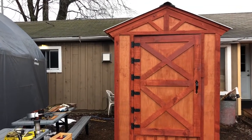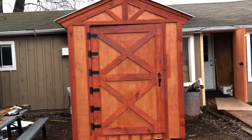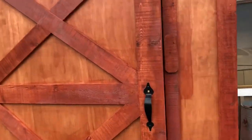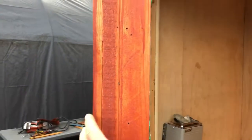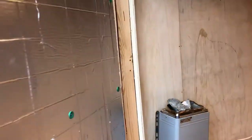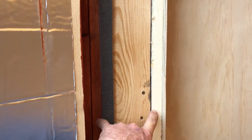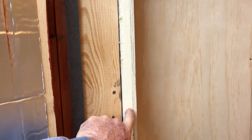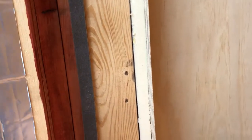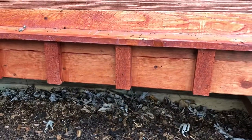What we have is a six foot by six foot shed. It's got an eight foot peak in it and it is very super insulated. The door is four and a half inches thick, basically solid insulation. The walls are a two by six in the center with insulation stuffed in it, an inch of insulation on the inside of the silverback styrofoam, and an inch and a half of insulation on the outside of the styrofoam. The floor is also fully insulated and has two sheets of three quarter inch plywood on it.